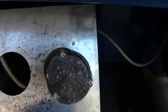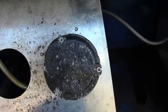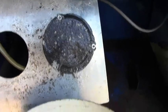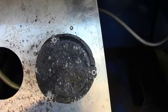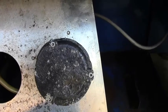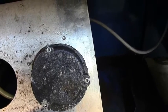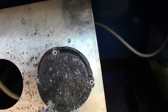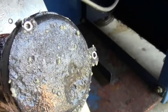Here's the original cast aluminium impeller housing, which I'm going to replace with a plastic one. I've had this apart recently - I had to replace those screws, they were corroded badly too. So I had to drill them out and then pull the remaining threads out with a set of vice grips, and eventually got it out. You can see how badly corroded it is.